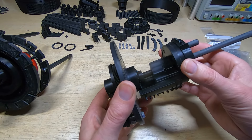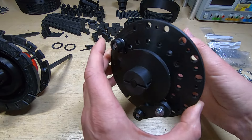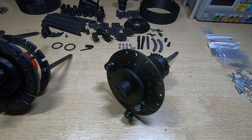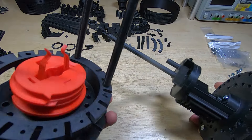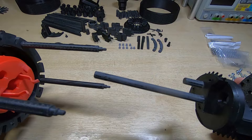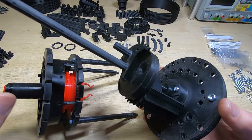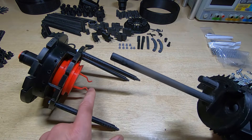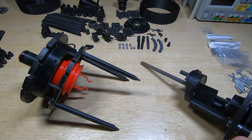When in the home position — when this wheel is in its recess — we should be able to move the assembly between the two positions. Once it starts rotating, we should not be able to change the mode. There's a half-moon cutout that only exposes the plate when in the home position. Going back to the home position, we can push this back; and once we start moving from the home position, it can no longer be moved between positions. That appears to be working correctly — that assembly is complete.